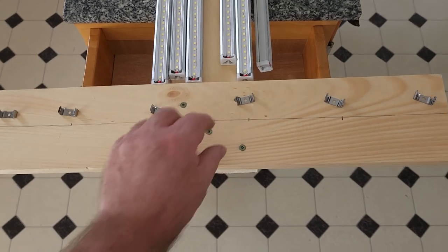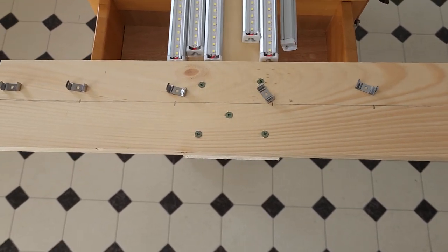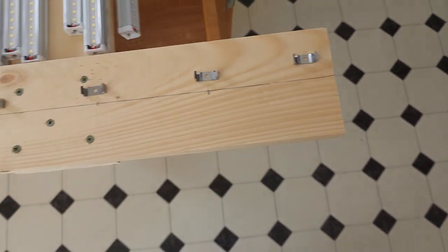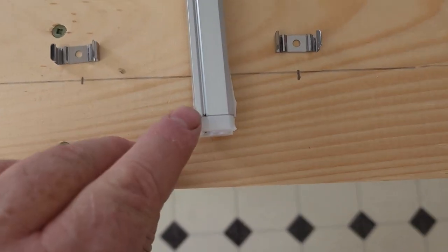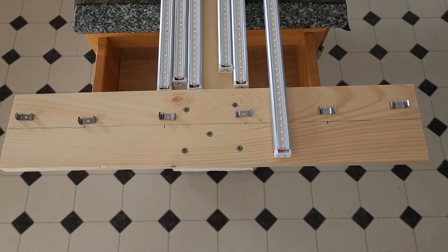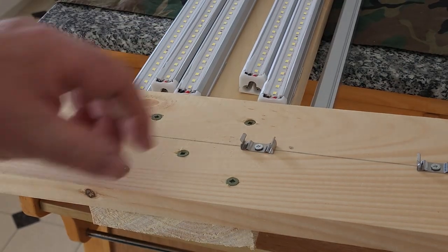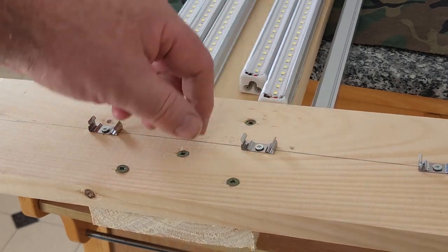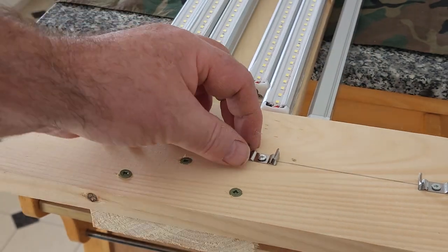This is how I mount them — they all come with slide clips. I just took my board, divided it by six, and for me that turned out to be four and a half inches apart. I place the clip on top — if you look closely, they're curved out — so you slide it into the grooves on both sides. I use a screw gun, but don't go all the way down because you don't want to strip it. If you do strip it, just break a toothpick, put it in there with some glue, let it dry and trim it off.